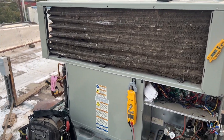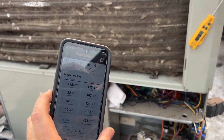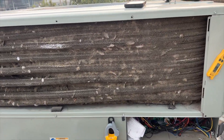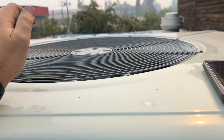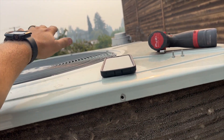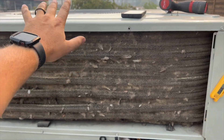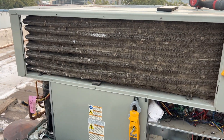We're going to put in a quote to clean this coil, but they are back up and running, cooling, pressures are no longer at freezing point, and I put in a brand new filter. You can tell what's going on with a system just by looking at refrigerant pressures. You can also tell by listening — the air is going whoop whoop whoop, blowing and then not blowing. Use all your senses — eyes, nose, ears, and touch — to diagnose. Thanks for watching; make sure you like, subscribe, comment, and hit the bell notification.